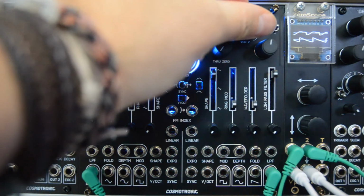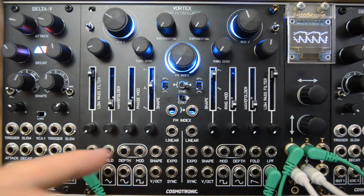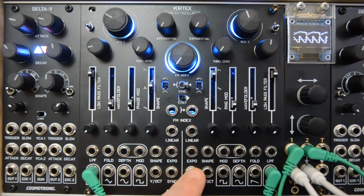And to conclude this section about sync, there's two sync inputs that override the internal normalizations. You can use any signal into these sync inputs. I've successfully used sines and triangles, as well as the preferred square waves into the sync inputs, and they all seem to work just fine as long as the amplitude of the signal you're sending into these sync inputs is high enough.